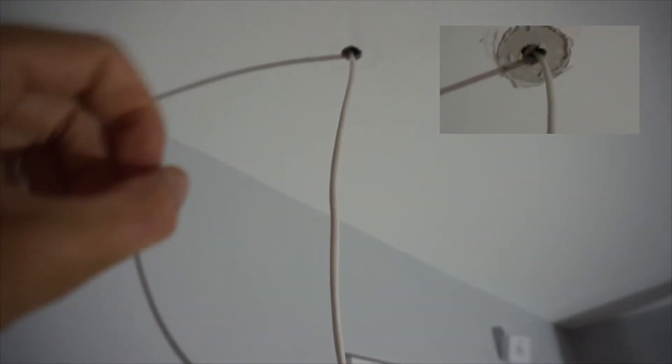We're going to pull it up here. I've tidied up the hole a little bit. What I've done is cut a hole out of some plasterboard, then cut another hole in the middle of it, and filled it in. Basically I didn't want the hole behind the plate to be that big, so I've done a quick fill, a quick sand, another fill, and then some paint. It doesn't have to be too good because it's going to be hidden anyway.